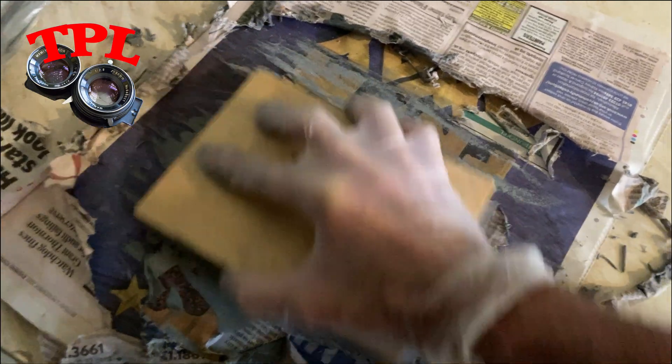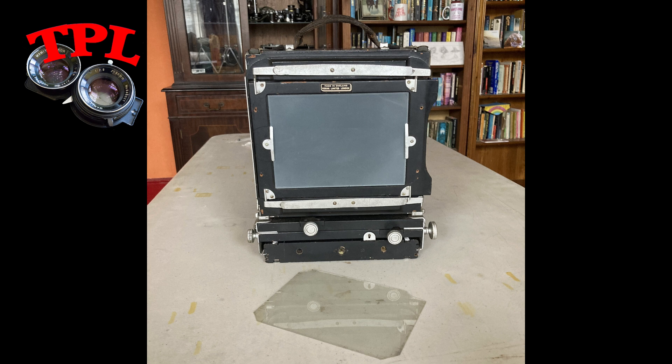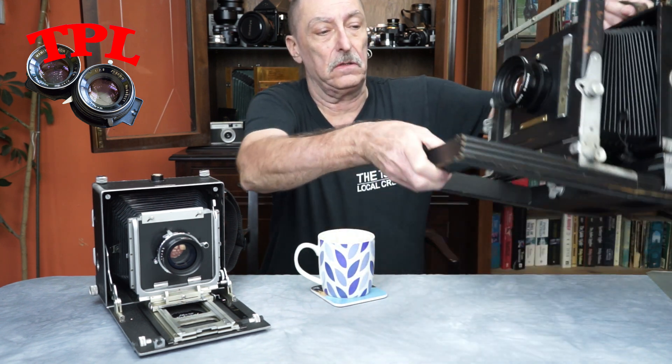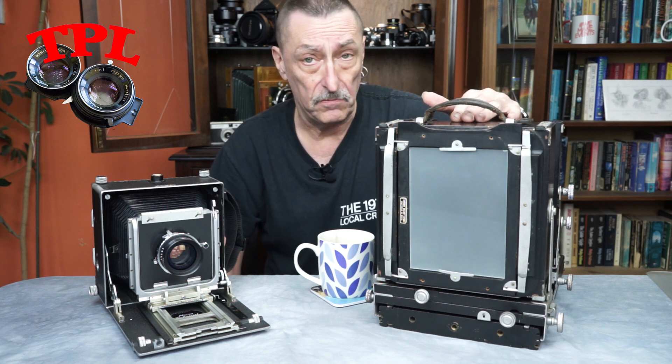As you can see, there was a bit of a horrendous mess created, but because it was all on newspaper I could pick it all up and dump it safely. Back to the rather sad old screen in the Kodak Specialist — you might notice that the corners are cut, but I decided not to do that on the replacement screen. Two screws to remove the clips, and in goes the new screen. And oh yeah — there we have it: a nice bright new focusing screen! This screen is probably two stops, maybe a little bit more, brighter than the original.